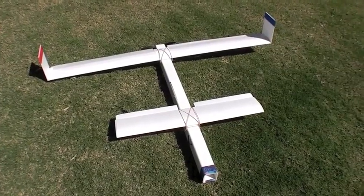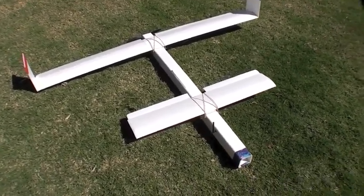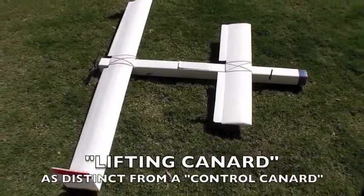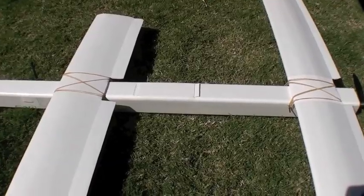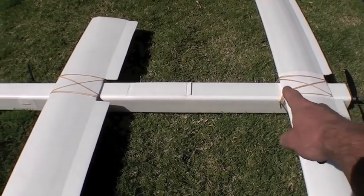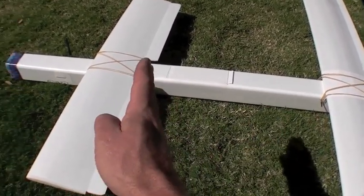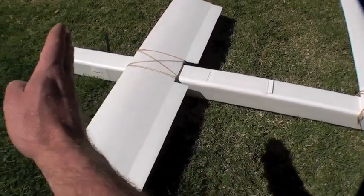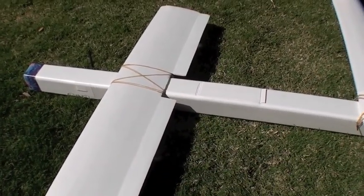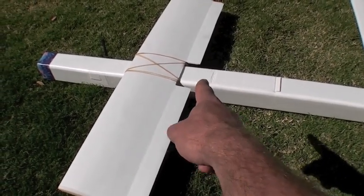So here is the Peace Drone version 1 — 60 inch wingspan, 45 inch length, 30 inch lifting canard. Part of the idea here was to use a pusher prop to keep it out of the FPV lens, and to put the speed controller and receiver completely on the back half of the aircraft, with the FPV gear and antenna fully forward, so there's a complete segregation of all the electronic systems except for the power supply to the FPV from the battery forward.